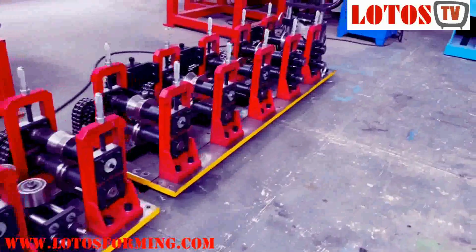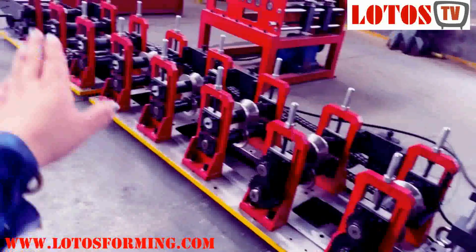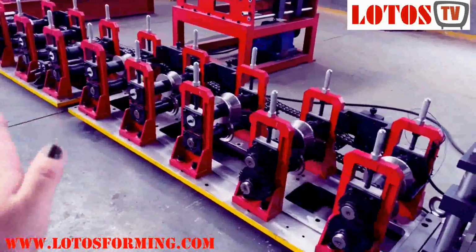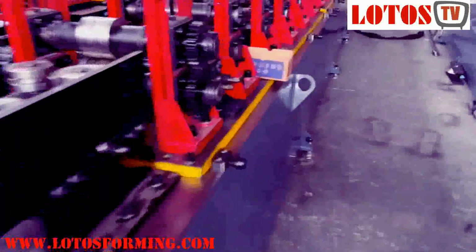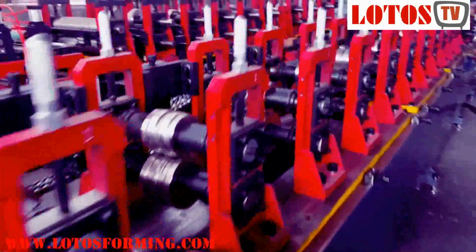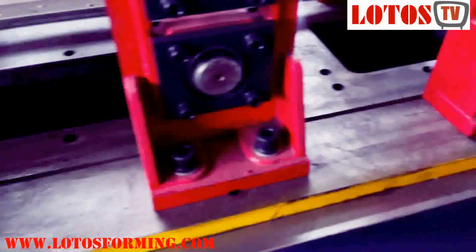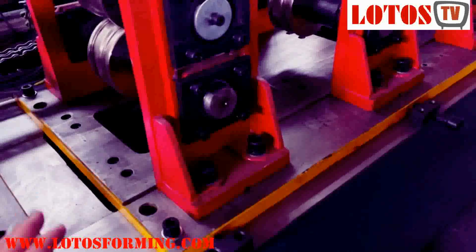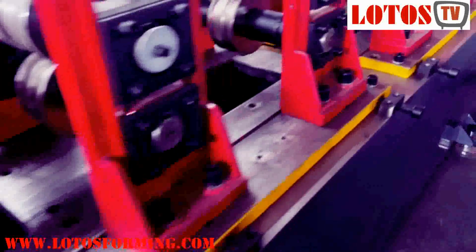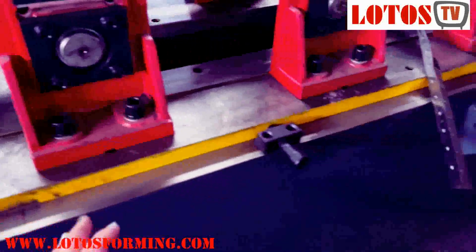This is what we care about, which we call fast quick change. The Turkish head and the feeding table will be well fixed on the two cassette units. Then it will be reloaded to this machine housing frame to settle down the secondary profile. We also notice that the surface of the cassette is well machined, and this sort of screw will help to settle down the cassette. Once we reload the cassette unit onto the housing, this screw will lock it in place.